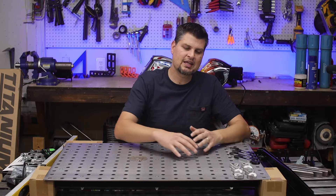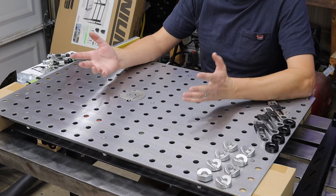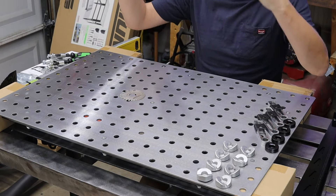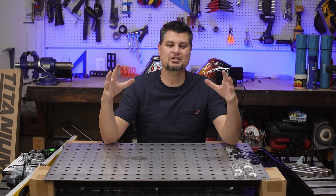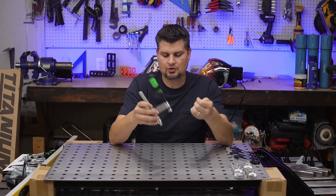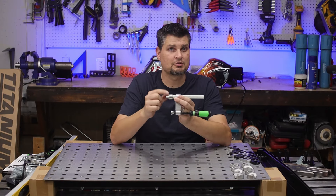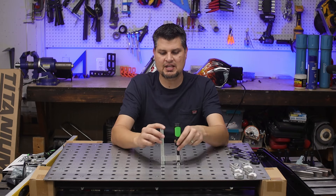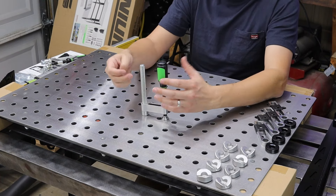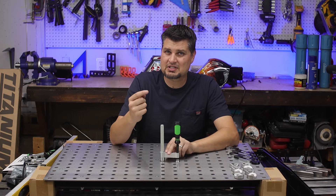The things you've got to watch out for: you can't do an extended period of welding right next to or on it — that heat will start to warp the table. Also, don't drop a whole bunch of weight on it; if you're redoing a transmission or something, I hope you wouldn't use this as your rebuild table for heavy parts. Keep it in the shop or garage for light-duty stuff and you are golden. Another downside with a thinner table is the type of clamp. It's great that these have clamps — you stick it through the hole — but on a thicker table you have a longer stud the same diameter as the hole, and you get solid clamping force. With a thinner table it just wobbles; you can't get that sideward force, so you have to stick the nut up underneath on the end, which takes an extra step.